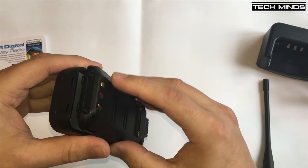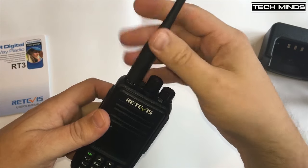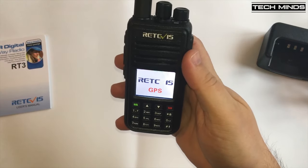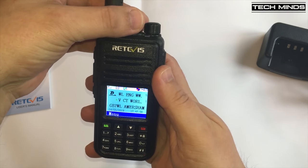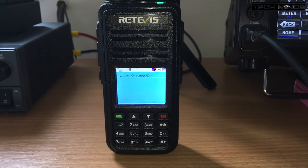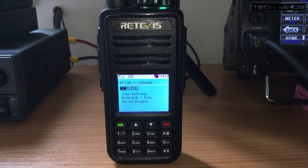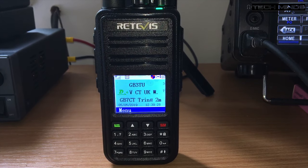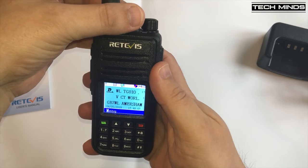Having the contacts database on the standard firmware is an absolutely brilliant feature and now supports up to 120,000 contacts. This allows you to download a database full of radio IDs which have the corresponding user's call sign and location stored within it. Once loaded onto the radio and you start receiving transmissions, instead of just seeing the DMR ID shown on the display, you'll actually see the details of the person who is talking. This is really useful if you didn't catch their call sign — you just take a look at the screen and you'll see instantly who it is, and if they've stored their name information in the database you'll see their name as well.